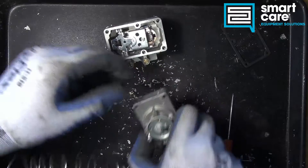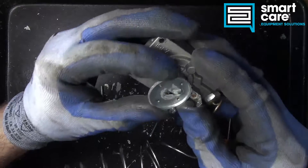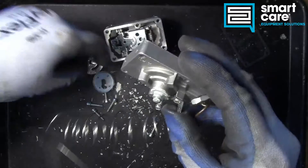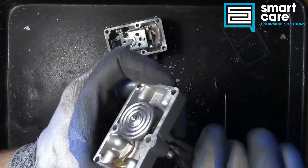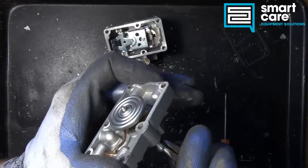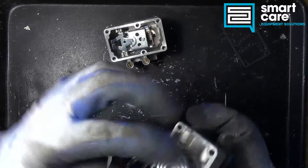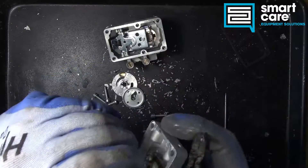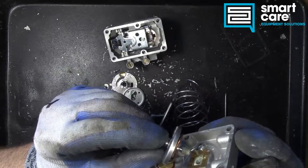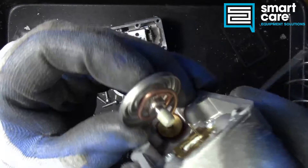With that removed, you can see there's a sort of slotted mechanism here. We pull that slotted mechanism off — it's a threaded mechanism, and as we turn this, we're unthreading part of the mechanism. With the valve assembled, unthreading that mechanism would put more pressure on the bellows. You can see what we just unthreaded there.